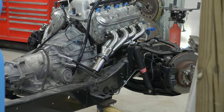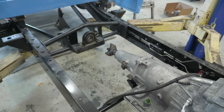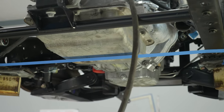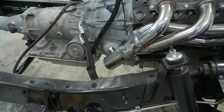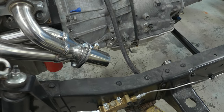The first step of this build is to step back and take a look at what we have to work with. We need to come off those headers, follow the frame rail straight underneath the cab, through that trailing arm crossmember, then kick up to the mufflers and over the frame rails to the side exit tips. A pro fabrication tip: masking tape. I'm going to run it from frame rail to frame rail as a guideline so I can visually see in open air where I cannot go below with my exhaust. I have two things to avoid right off the headers — the transmission cooler lines on the passenger side and the fuel line on the driver's side. So I don't want to come straight off those headers; I need to do a turn down and then a turn back.